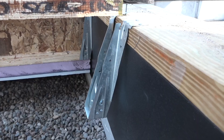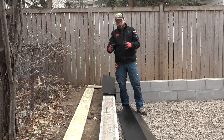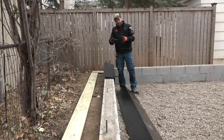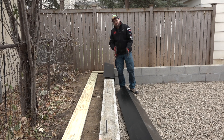We are going to be hanging our framing off of the foundation here, and so we wanted to do a couple of things. We want to protect the wood from the masonry — that's the capillary break, both at the ends of the framing and the bottom plate. We also want to think about termites. We don't have them in the north yet, but they're coming. So how can we put a termite shield in there that will protect our wood framing? And also, because we're putting two inches of insulation and sheeting on the outside, we want to make sure that it extends far enough out to protect the underside of that foam and sheeting as well.